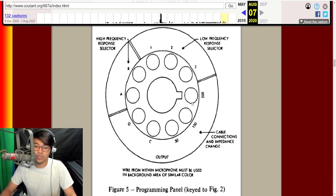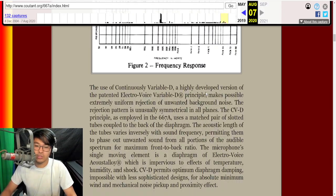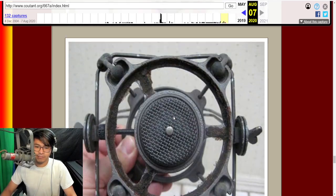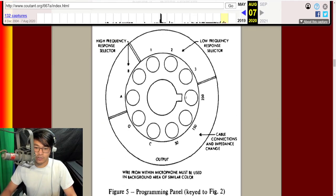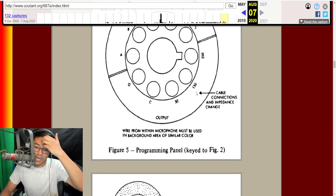Here's the wiring diagram for the filters. You don't want to be changing G and C — I think that's ground and common — so don't plug or unplug that. But you would want to change A and B, and one, two, three, and also 50, 150, and 250 ohms. These options correlate with what is on the graph: A is your brightness boost, B is flat; then one, two, and three respectively — one being flat, two being a moderate low-cut curve, and three being the most aggressive high-pass filter. Then you have the impedance changes from 50 to 250 ohms.